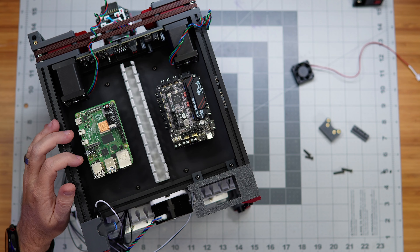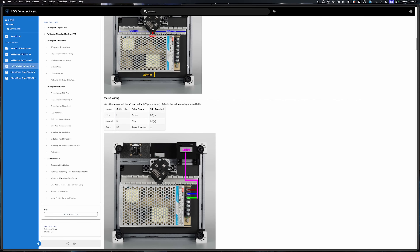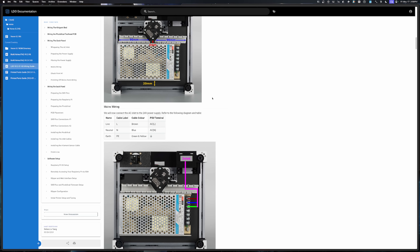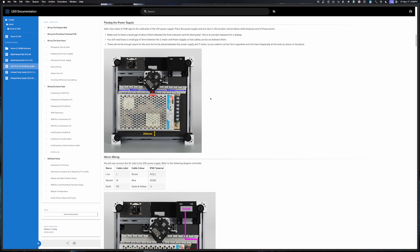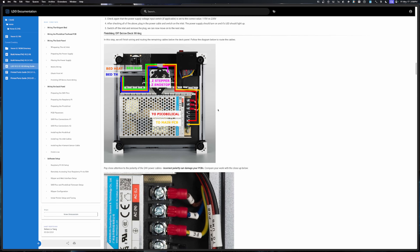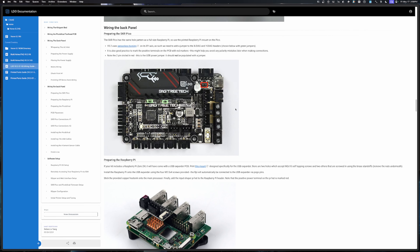The LDO guide I'm looking at is actually quite good — they've got diagrams for each of the different components for how you need to wire things up, and nice pictures showing what I did on the bottom of the machine, even with dimensions if you want to be very precise. It's important to follow the positioning guides, because this kit comes with pre-crimped and pre-cut wires that are labeled and cut to fit in certain places. If you don't position components how they expected, the wires might not be long enough to reach.